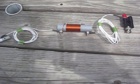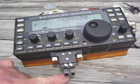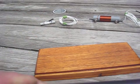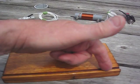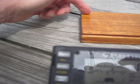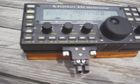Now we get into the radio — the radio being a KX3. With the paddles, when it's tilted up and it's on the table, these paddles are a little low to the ground. When you tuck the feet in the back and lay it on a table, these paddles are a little bit too high. So what I did — and I have it on my web page which is ku3x.net, November Echo Tango — I tell you the dimensions on it. I cut a groove in here. This is three-quarter-inch wood, and the feet on the bottom of the front of this will rest right in that groove. The feet that tilt the radio up will rest right on here and it makes a nice elevation for CW. When you send CW the paddles are at the proper place.